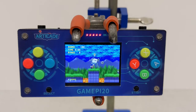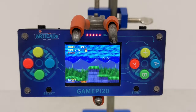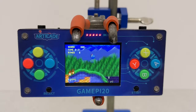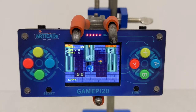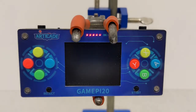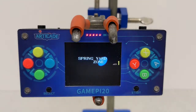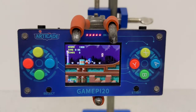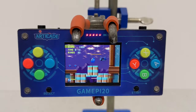I was surprised — they responded very quickly. They told me to use a second method: installing a fresh install of RetroPie, the latest version, onto an SD card, then using SSH via PuTTY — since I don't have an HDMI adapter for the Raspberry Pi Zero W — to install all the drivers separately. I followed the instructions and managed to get all the buttons and screen working, but the sound isn't working yet. While recording this video I still haven't had a resolution, but I know the sound works from the original build, so I'm confident the WaveShare team will send a fix.